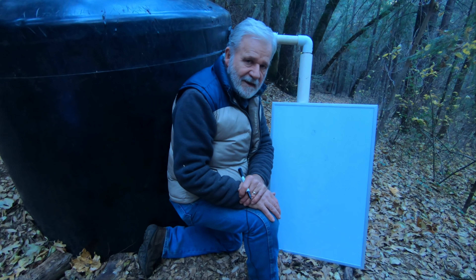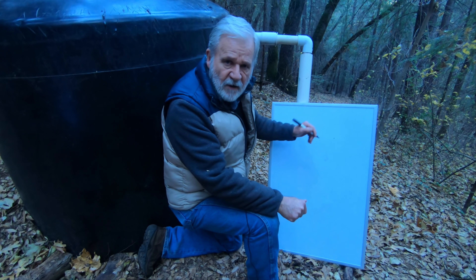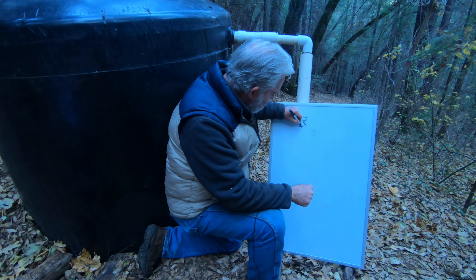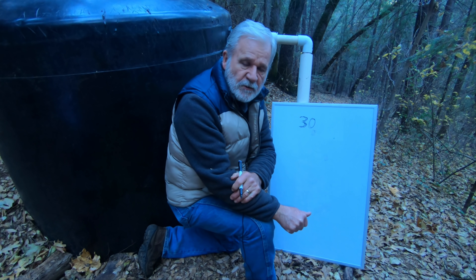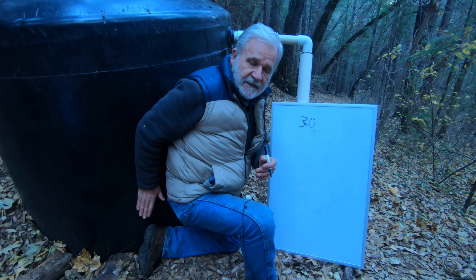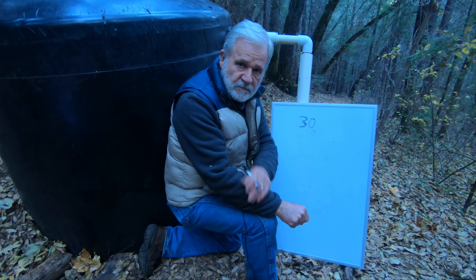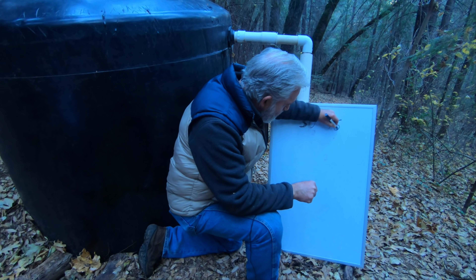Okay, let's go back up to the tank. We've measured water flow and figured out it's about 30 gallons a minute. So back to the blackboard — we've got our 30 gallons here. Now the next thing you need to measure is your height, your elevation: how far above your micro hydro plant is your tank. For us, our tank is about 160 feet above where we want to put the micro hydro system. So I'm going to write that number down — 160.